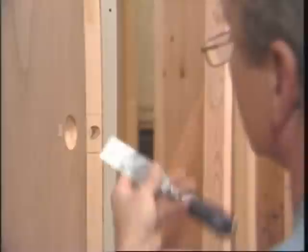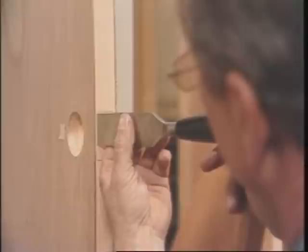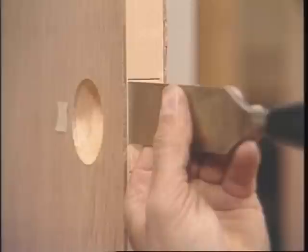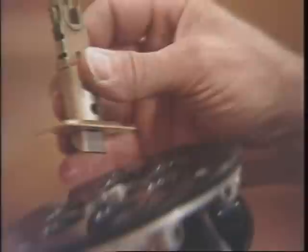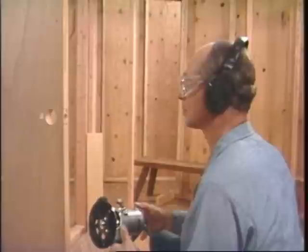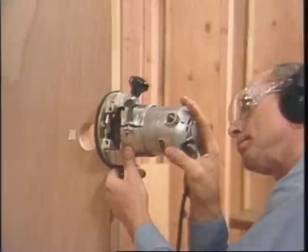When I take it out, I'll chisel this line and then route it with my electric router. Use a wide chisel now with the bevel in, but be very careful about this — too much pressure and you could really split that right out. This is just a score. Extend the line and just widen this a little. Here's the latch. I'm going to route this freehand, so here's how I set the depth. I don't try to make a finish cut with the router. The big advantage is to establish the depth. I stay away from the lines and then clean them out later with a chisel.